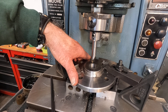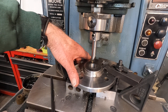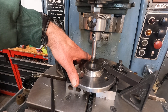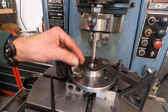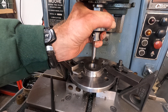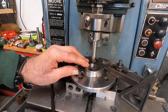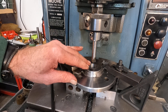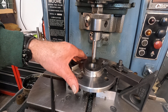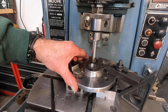It never makes sense to hold close tolerances on mild steel — sometimes you're better off using high speed steel. There are times I've had to hold closer tolerances on lesser quality steel. So what I'm going to do is pull the tool out and sharpen it again. We'll run it through again, back the speed down, and get a clean hole out of this. I didn't have a very clean hole to start with from the lathe, partly because of the two different materials, which makes this an interesting challenge. I'll punch ever larger holes with the machine and talk about its capacities as we go.